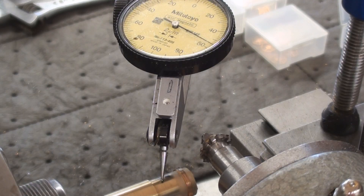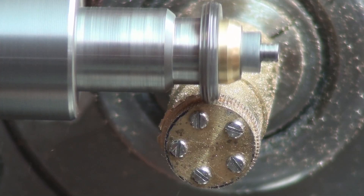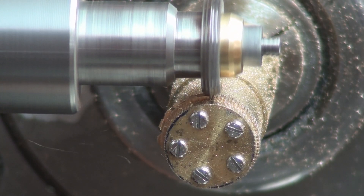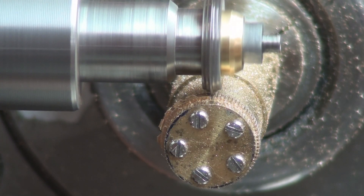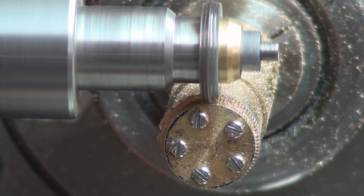As you can see, it's true and ready to start machining. We use a standard module cutter, and on each tooth we make four passes — that ensures we get a very good, high-quality finish.